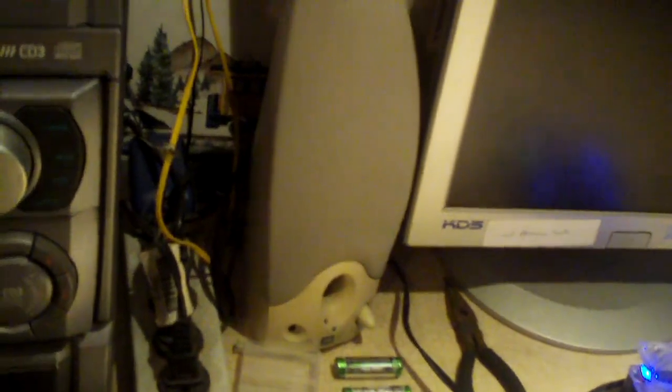The good thing about this setup is it's easy to connect things when you need to. Just last week I connected these speakers — all I had to do was find an old wall wart that had the same kind of plug on the end, get the polarity correct, heat up the soldering iron, strip the ends of the wires, and solder them right in. Now I can run the speakers without an extra plug being used up, and I still have this plug available when I have a computer for service.